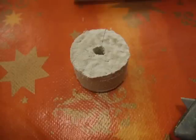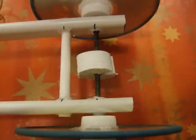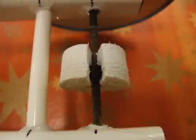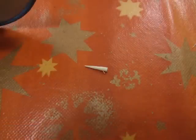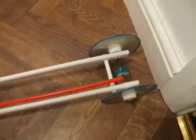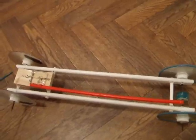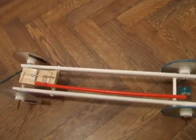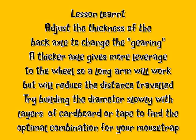After making that video, it occurred to me that rather than reducing the length of the arm, I could increase the diameter of the back axle, and that would have the same effect. So I got a bit of foam rubber in a circle, added that to the back axle, taped it in place, put a little peg on it, and tried again — and hey presto, it works fine. Now, obviously there's an optimal size. The skewer on its own was too thin, and the foam I've added is probably much too big. So you could play with this yourself and find the best size axle to get the right sort of gearing to get your mousetrap car moving up the track to the best distance.